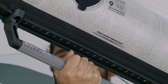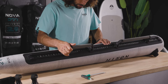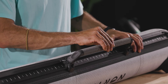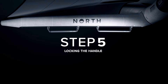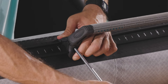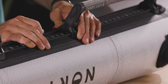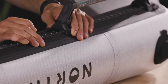Slide into position using the centerline markers on the strut as a guide. Before tightening the screw, slide the handle back and forth on the track to ensure the channels are correctly engaged and there are no external residues. Holding the mount in one hand, push both clamps together as you tighten the T40 screw fully. This helps to align the channel securely. Ensure there are no gaps between the channels and the shift lock tracks and the screw is fully engaged.